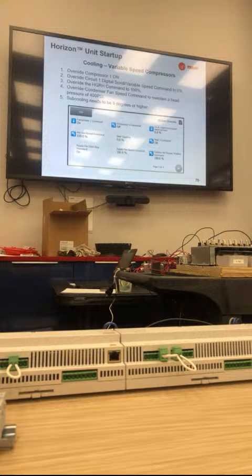The reason, we have found, with variable speed and the reheat coil and everything, is that your unit requires 30% more refrigerant at part load than it does at full load, which sounds really backwards, but it needs that because at low loads, more tubes are full of liquid. It's requiring a lot more refrigerant in them. We don't have as much discharge gas going through the condenser. That condenser can have three-quarters, almost the whole thing, full of liquid.